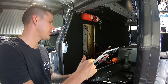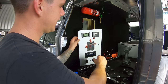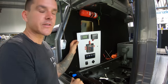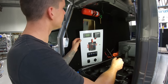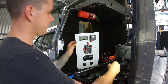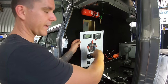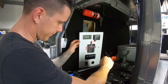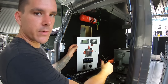Now that the panel is off, I'm going to take off this old solar controller first and see if the new one even fits in that spot because it's a lot bigger. I don't think it's going to fit there, but it can hang over — it's not the end of the world. I'm going to de-wire it and basically cut everything. There's no battery hooked up at the moment because I've had it on charge, so there's no voltage in here whatsoever and we can just snip away. Then we can start hooking the new one up.